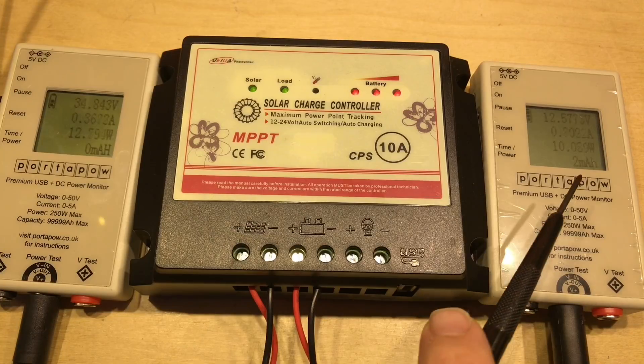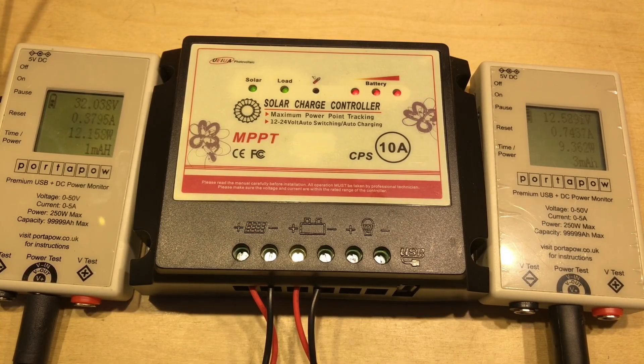I've plugged in two 50 watt monocrystalline panels in series. The open circuit voltage was about 40 volts. We can see 13 watts coming in, 10 watts going into the battery. But that's dropping quite rapidly as the panel voltage also drops — down to 22 volts, 21 volts now on the solar panel. What a shame, it's dropped to somewhere close to half the maximum power point. These panels won't be producing as much as possible down at 16 volts, but we've still got 5 watts going into the battery.